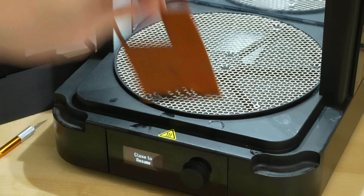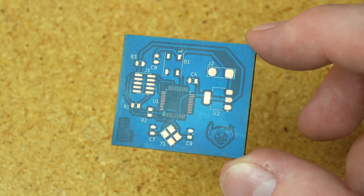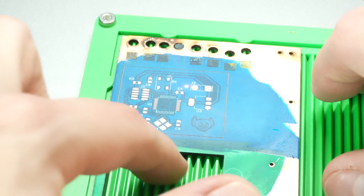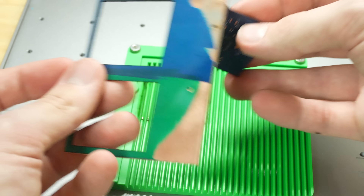Cure that, and then you cut away all the normal solder mask layer — and it works really good. I kind of can't believe that I made this on my bench. And then you can actually cut out the board as well. With enough passes and a low and slow enough power, you can fully cut through a PCB and even drill a bunch of holes.